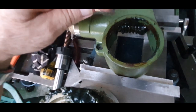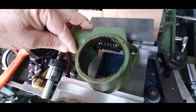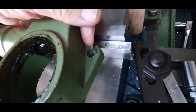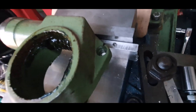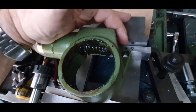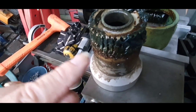So what I'm going to do is — on here you've got two sections, you've got one bolt there, then the other bolt is here. This one here will be just very snug. This one here I can actually elongate upwards, probably a half a mil, maybe a mil. Then that will give me a very fine adjustment — by allowing the bolt to be able to come up, because this will come down, then that worm will mesh a lot better onto the gear system.